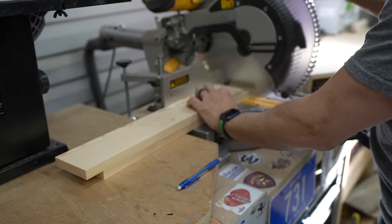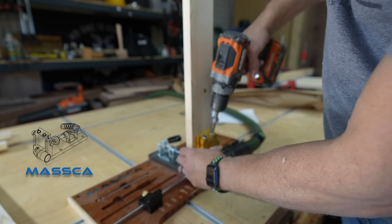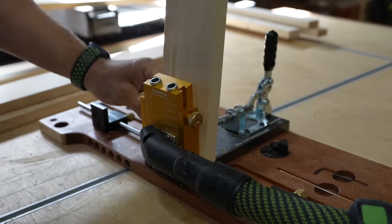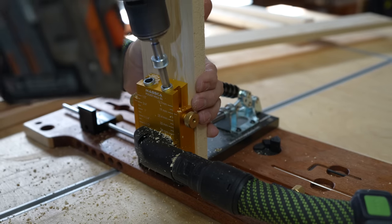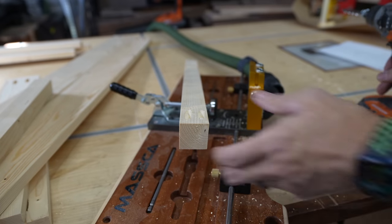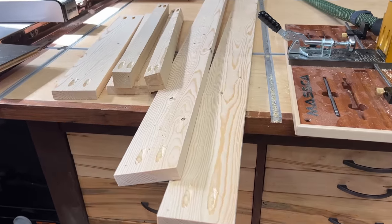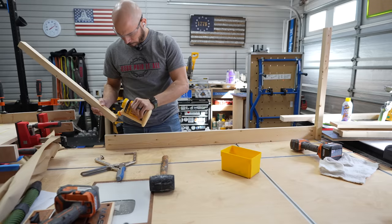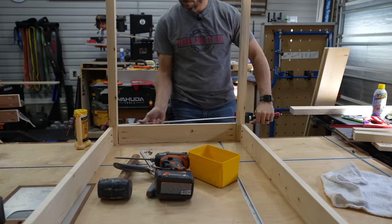I cut the shorter aprons to size and also cut two-by-twos for the lower apron. Then I started drilling pocket holes for the joinery — and that's today's sponsor, Masca Products. Masca makes an awesome line of pocket hole joinery tools, and this is my favorite, the Masca M2. It's super easy to use, makes a super strong joint, and is very approachable for beginners and intermediate woodworkers alike. I went with two pocket holes per joint for a nice solid connection. Even on the two-by-twos, where they're close together, it still gives you a solid joint. I use glue at every joint, even with pocket holes — that'll keep everything from creaking and squeaking later. We're using inch-and-a-quarter screws on all of these joints.